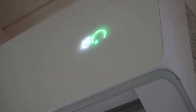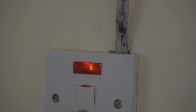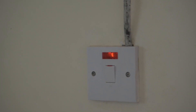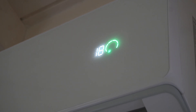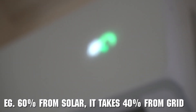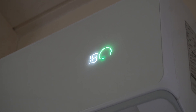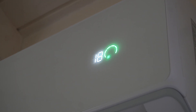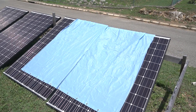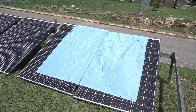In the event of cloud cover and there's not enough energy from those solar panels, once this switch is on, what it will do is pull what it needs from the grid. It will not just drop all the power it's getting from the solar panels and start pulling from the grid — it just pulls what it needs from the grid. What you will see is a red indicator with a sine wave, and I'm going to show you that. Instead of disconnecting it, I'll just use something to create shade on two of the panels and then go inside and show you what happens.